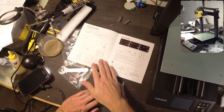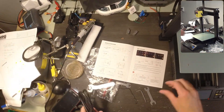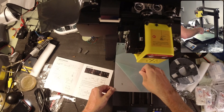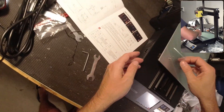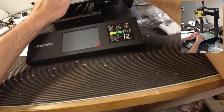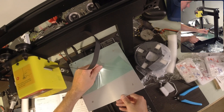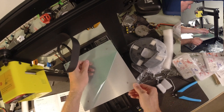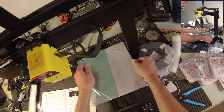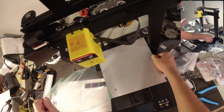The next thing is going to be bed leveling. We're going to go ahead and plug this in and start working on bed leveling. Before we get to that though, I'm going to take this acrylic off. Look at that — that is not good. The wheels inside there, the bearings are not tight inside the wheel. I'll probably have to take them out and maybe put some super glue on there. You can see how the whole bed moves — there's like major noise.